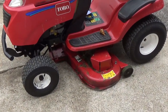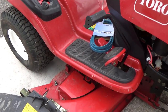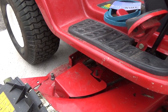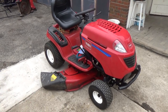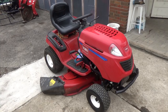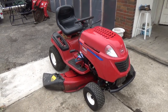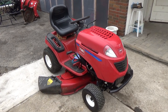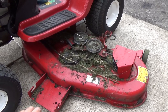What you guys are going to be interested in is the mower deck. We've got a little bit of debris on the top — that's because our customer doesn't take the hose to it after cutting. There's a little bit of dry grass building up underneath the belt guard, so I'm going to pull that off and clean it out. Normally we'd power wash the machine completely, then pull the deck off and flip it upside down. But for this video I haven't touched the machine at all — just an oil change — so I'm going to pull this deck off, flip it, and show you guys how well the undercoating works and prove the grass doesn't stick once it's coated with the corrosion-free rust inhibitor.